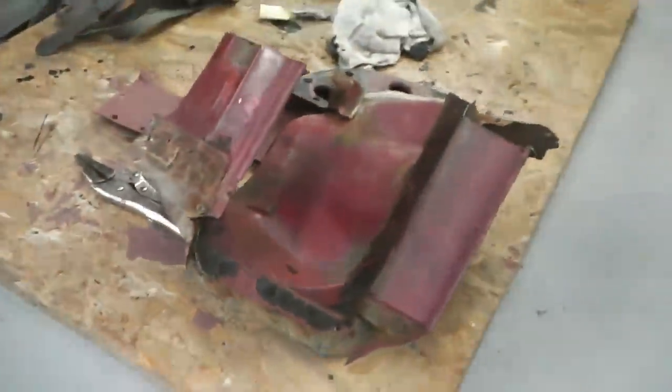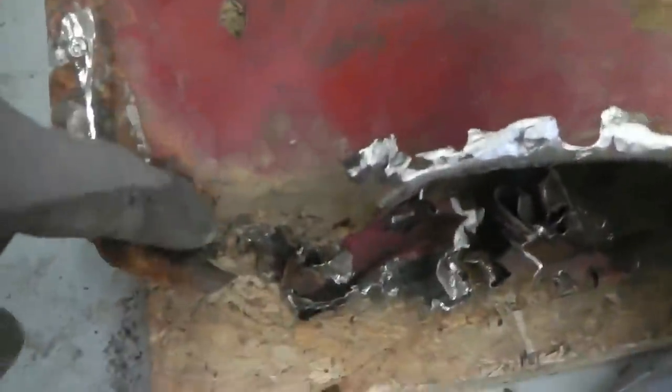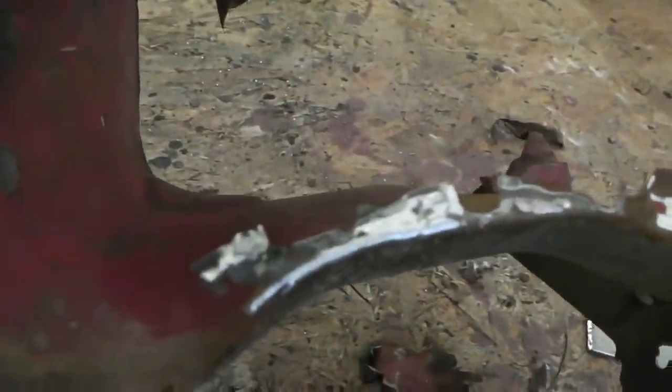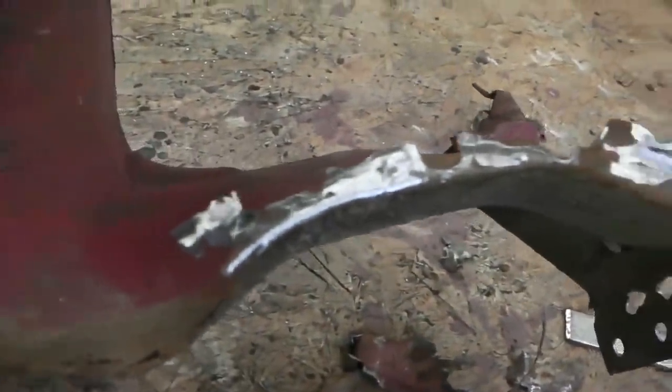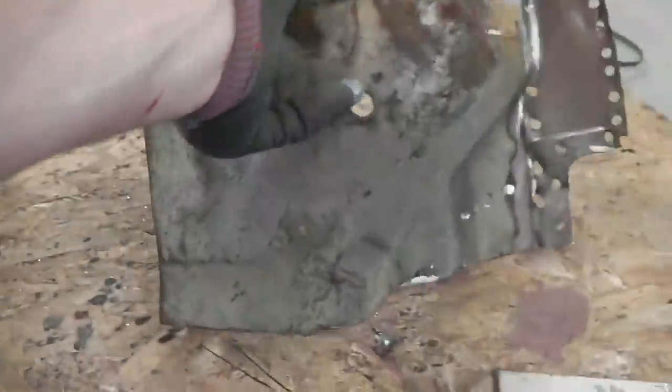There's a lot to do to clean that up. I don't enjoy cleaning it up, ripping all the bits of old metal off it there, see, and getting it back to shape. Now look at it, look at that little drain. This is a sort of drain bowl behind the headlights where water would fall out onto the floor of the car, away out of the car. So the water runs down on your apron, gathers on the inner apron and rolls down out of the front. So it's damaged there, they always rust there. A lot of Cortinas have that problem, so we need to chop that out.